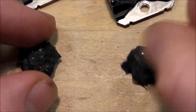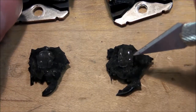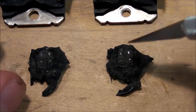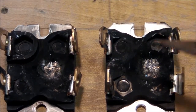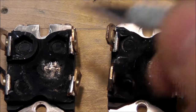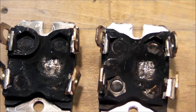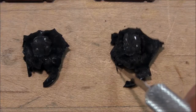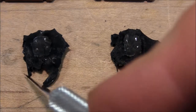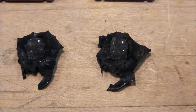On the other side of these things, you've got the four bond wires that went to the emitter of each transistor. Those four bond wires all blew, and there are actually four little pockets blown into the semiconductor die where those things blew up. There's even a little tail coming off here — those are absolutely amazing, I'm totally stunned.